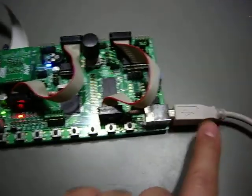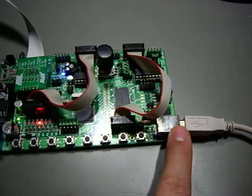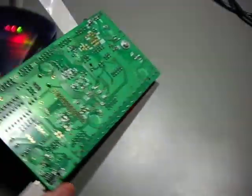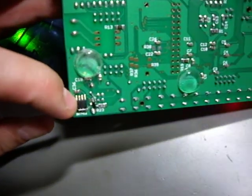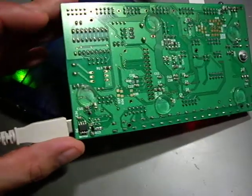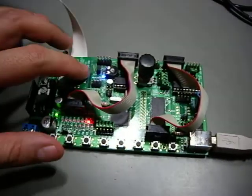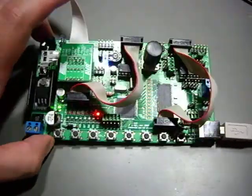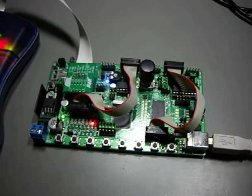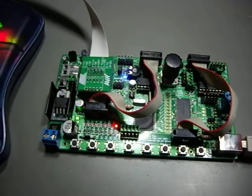One thing to notice: you can power the board via USB and draw 500mA from USB without violating the standard. We used a transistor, and the board had a little bug here, so it needed to be patched up — this is all documented. It needs a little patch to work correctly, and now you can draw 500mA from USB. The funny thing is that a lot of commercial products out there are not standard-conforming like this — that's very noticeable.